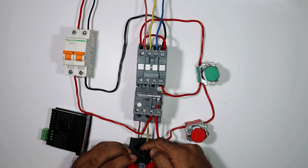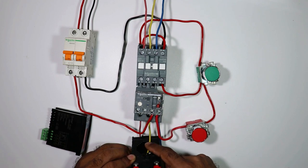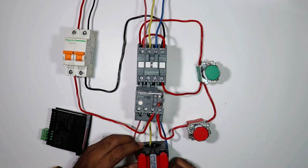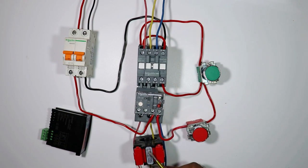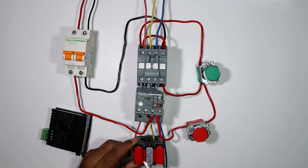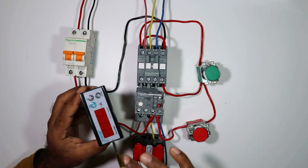Current must flow from P1 side - this is our P1 side. So we take the phase supply from here and connect this wire with the motor now. Now what we have to do is connect wires with the S1 and S2 terminals of the CT. S1 is this one and S2 is this one. With S1 and S2 terminals, connect the wire and provide feedback to this ammeter.